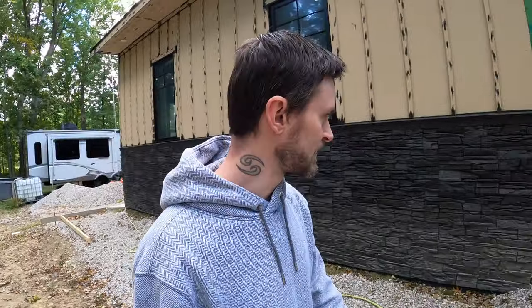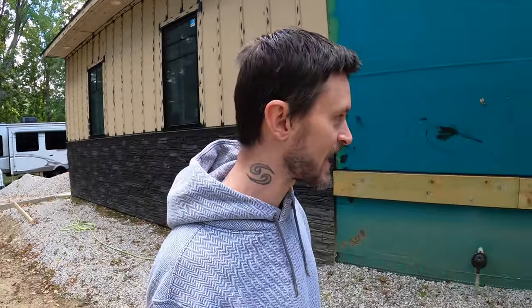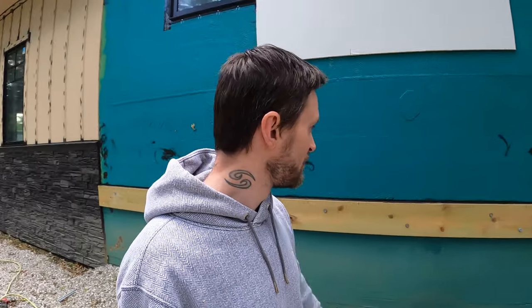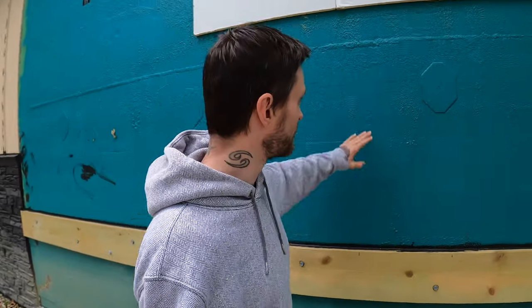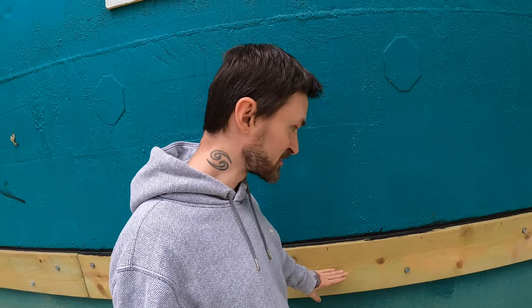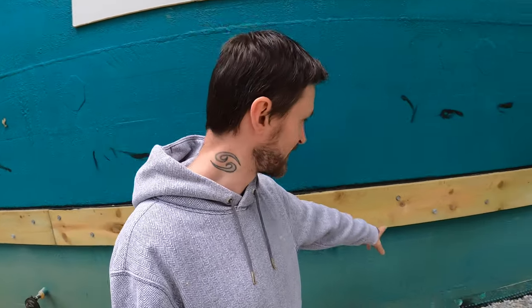Well, scratch that idea. I just busted it out. I was gonna put a few more extra in here because those bolts only come 20 in a pack. I was just gonna throw them in for some extra support because the tapered ICF blocks are actually up here. Because these aren't tapered, I just wanted more bolts in these, more like 16 to 12 inches on center. But they gave me the wrong freaking bit.